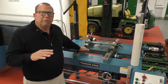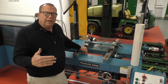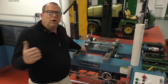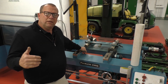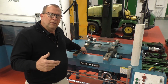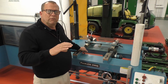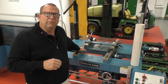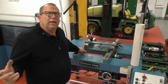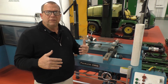That all references a fixed reel type of cutting unit with a movable bed knife. On movable-style reels like the John Deere QA7, you will always have that secondary setup process on the surface plate, because in that style the top face of the bolt-in bed knife forms the cut line and you move the reel down to meet that line. No matter whose grinder you're working with, whenever you have a movable reel you're always going to have to do your final setup on a surface plate.